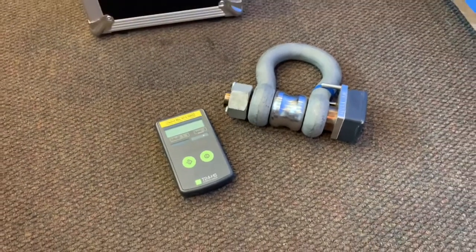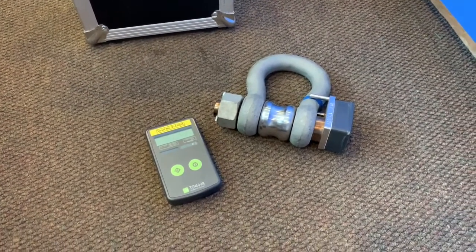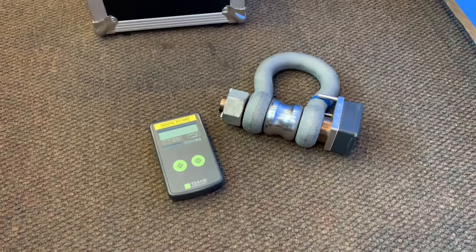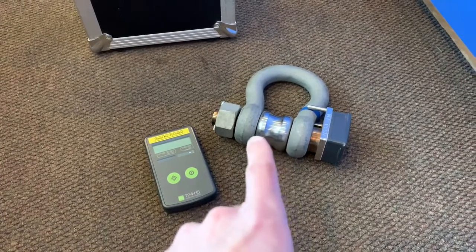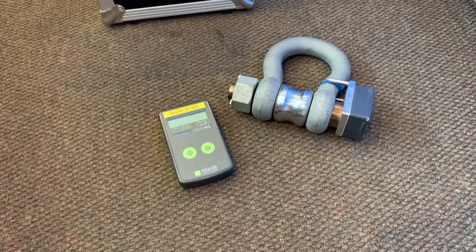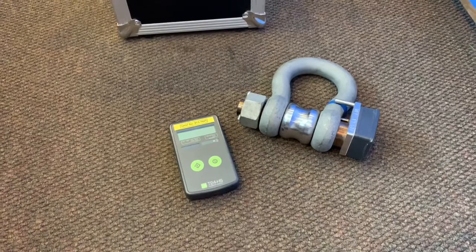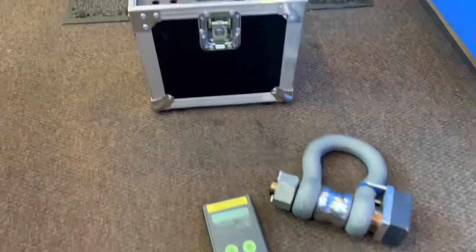Are you nearing capacity? Are you about to snap a wire rope, let it go, or shock load the line? Are you working within its capacity? These are really cost-effective — if you want to try this one, I'll mail it to you. Think of it as essentially the cost of one gear. If you were going to break a winch and you could have given your operator this to avoid that damage, you'll save on downtime and parts, and you get the knowledge of whether your winch is working properly.